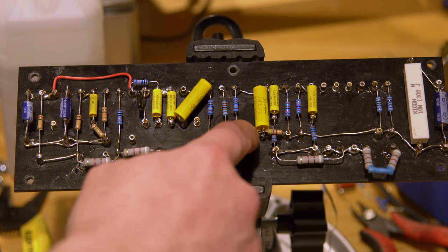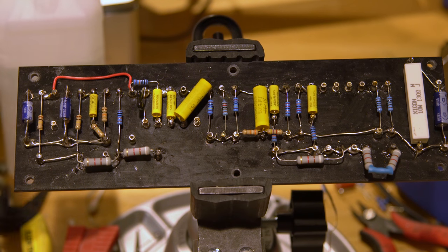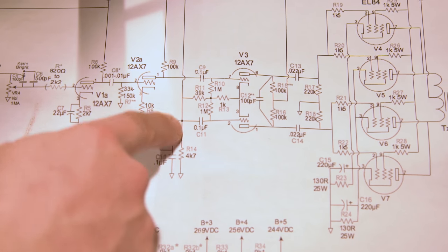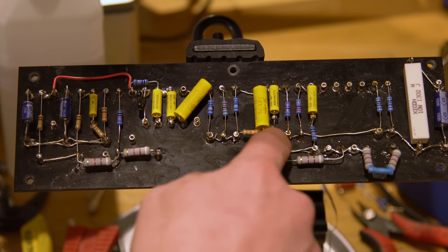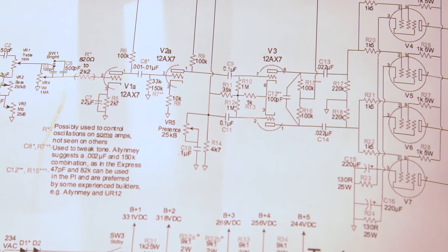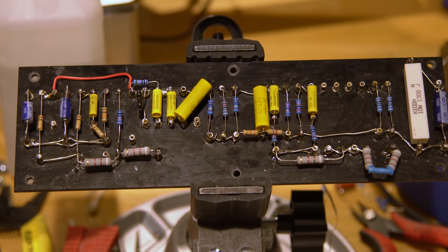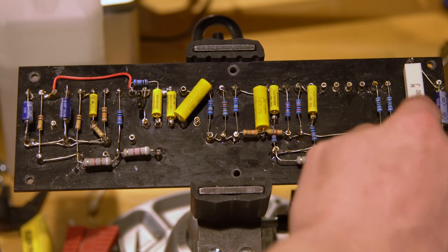There's an interesting one here — a 39k resistor that ties off of the center of these. I'll show it quickly: that's this part right here. So that's the 39k, but then it also comes down to a 4.7k to ground, which is what this guy jumps across to because that's my grounding bus. I will also connect this off and down to the presence control, which will have another 0.1 microfarad capacitor connected between presence and ground.